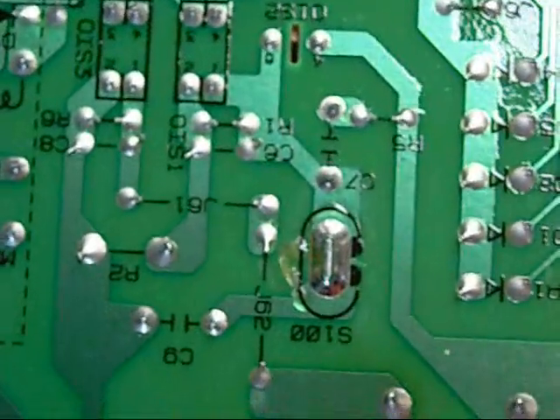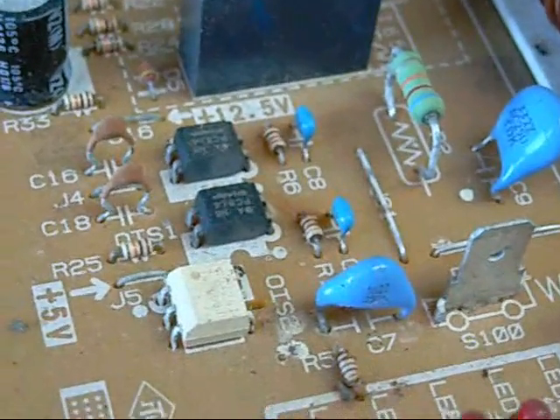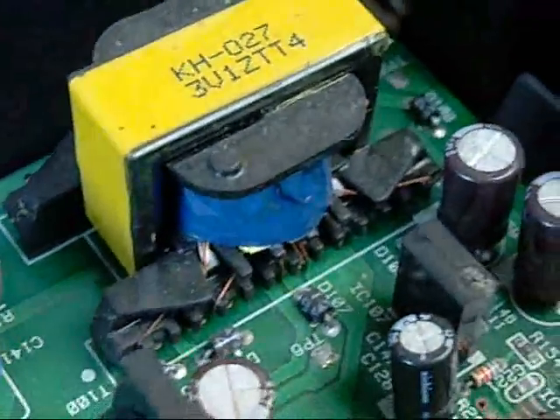The solder joints are all good - it's the DC bus. I'm not sure what's wrong with this one. I'll have to get a meter out and just check the voltages. It has to receive 12 volts from this power supply, and if something's gone in there then it won't be getting its voltage for the relays to start. Although one of these coils is emitting a high frequency sound so it is getting some power, but these 12 volt DC coils aren't getting any power - so the problem's probably in this board here.